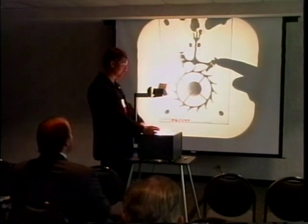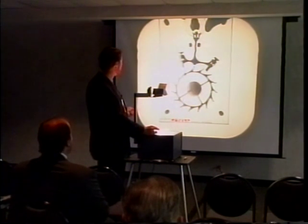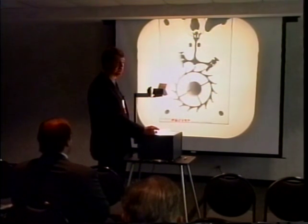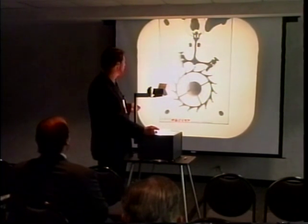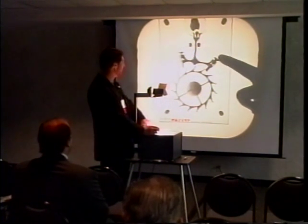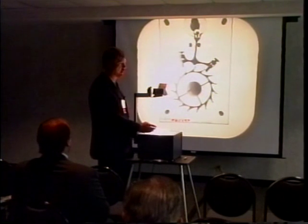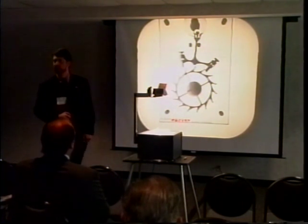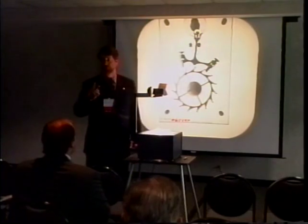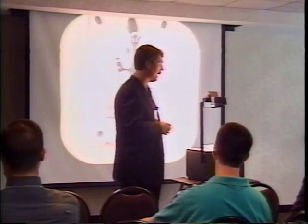And while this is taking place, at the other end, we've got our impulse that takes place. At the moment that we have the two let-off corners part and we have contact here, what's that called? The action is drop. The moment it touches is lock, correct? Okay, so we have drop, lock, then slide, and then when the pallet fork reaches the banking pin to the deepest point of the lock, slide is over, what's that called? Total lock. So we have impulse, drop, lock, or drop to a lock. It's a little more descriptive, so I'll say drop to a lock, slide, and total lock, okay?